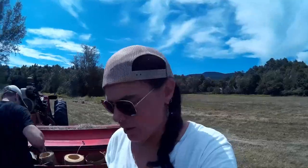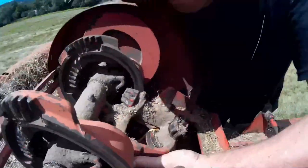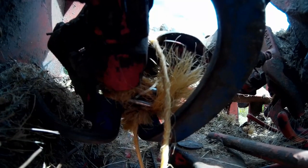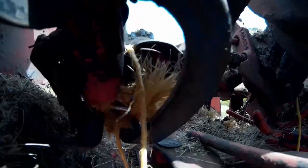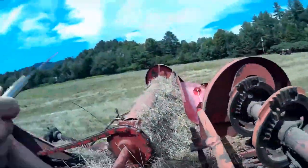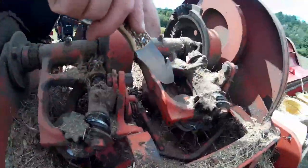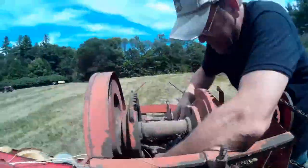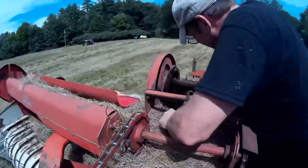We're still having massive baler problems. Oh look at all that knotted twine in there — we've got to cut that out. So it might just be a major jam. There are serious layers in there. That's probably what the problem was. Going back: it probably was the fact that we didn't have the tensioner running, and maybe the twine bounced forward and caught on the knotter, causing a little extra slack that bunched up and started causing a problem.